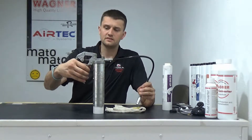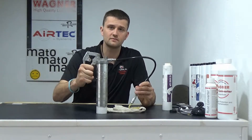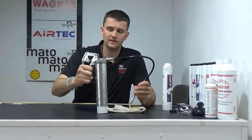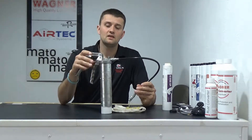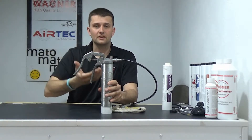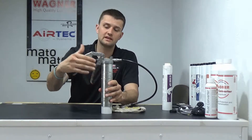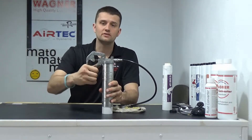Sometimes people call and say that their grease gun isn't working, and the reason is they're taking little strokes — like a half stroke on the handle — and it doesn't give that piston inside enough of a stroke to go all the way back, create that volume, and bring that grease up. So you've just got to make sure when you depress that handle, let it all the way back out every time.